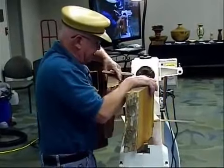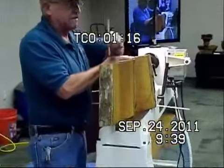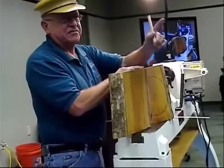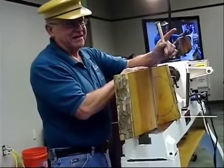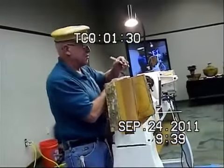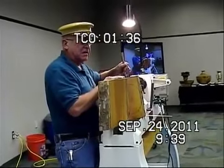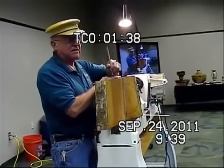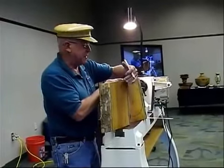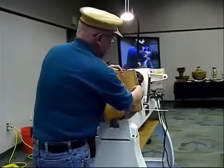Turn this around. I take the big piece with the heart in the middle, and I cut 4 legs out of it, 2 on one side and 2 on the other. It gives you a spare. It's just firewood, right? Shit happens. You need a 4th one sometimes. So you cut it down the middle. You can either throw that away, but generally, if you got a seat over here, you got enough room to cut 2 legs off of each center. If you know your good straight wood's out here, cut 2 legs off of here and here and throw the bed in the middle if you want. But this is all you have. That's all it is. 4 legs and a seat.